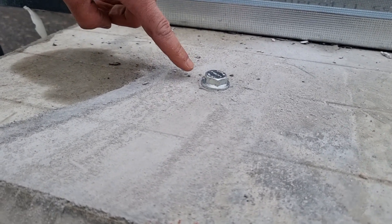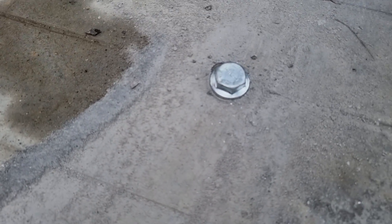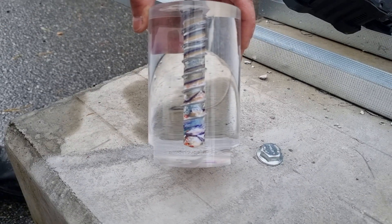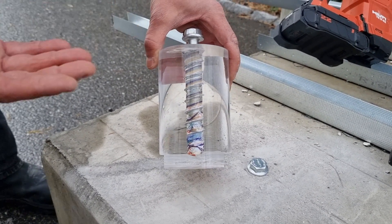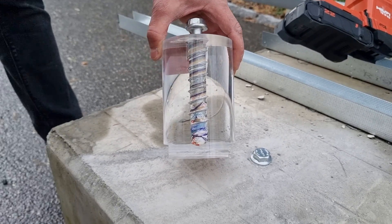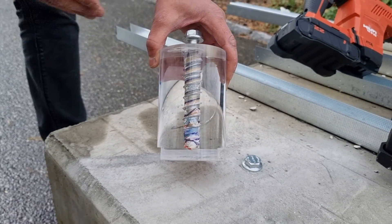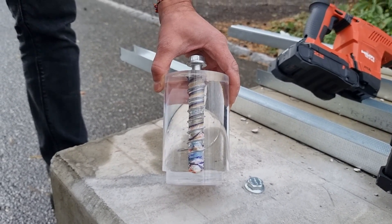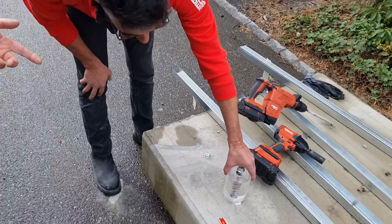You can see a little bit of mortar outside. The screw destroys the capsule and mixes the components inside the hole — that's why it's different colors, because it's different chemical components. You still have some time to adjust the base plate because it's not fully cured yet. How long does it take? About an hour, depending on temperature. Really impressive — makes the job so much easier, and not having to clean the hole is great.